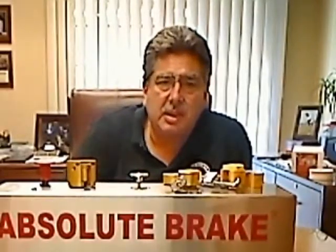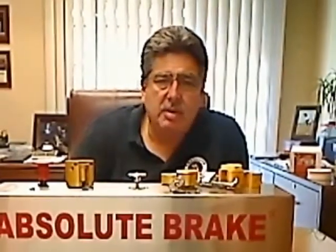Some of the manufacturers sent this valve out without the jam nut, so we've had occasions where it backed off and then they pulled it off and pulled the threads off with it too.